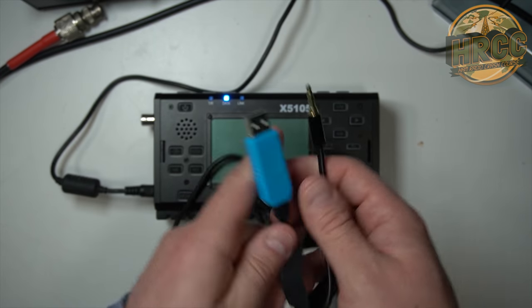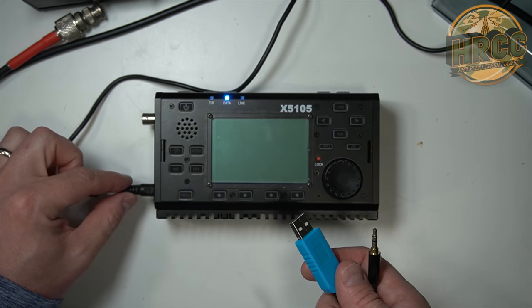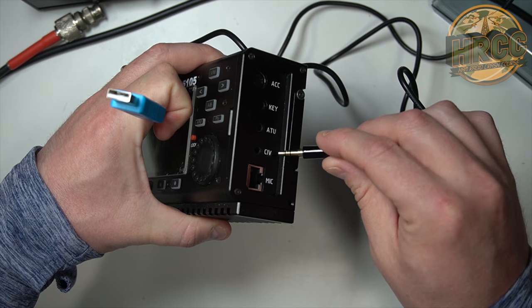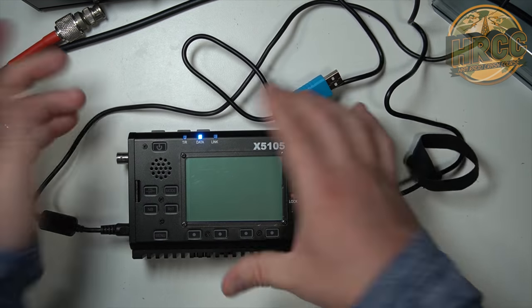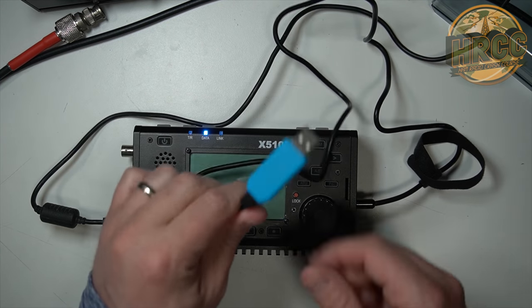To do this, you need to have the radio on — hold the two volume buttons and plug in the power. That's it, you don't touch this. Then you're going to take this connector and plug it into the CAT port. You need to push this in as hard as you can and make it seat all the way down. The first time I did it, I didn't push it in all the way and I wasn't able to get the terminal to acknowledge it. Once that's done, connect this to your computer.